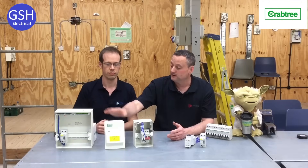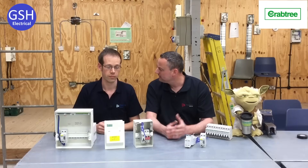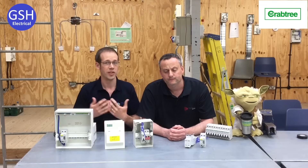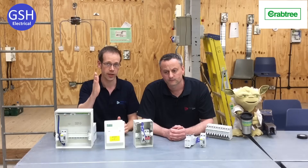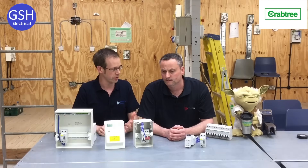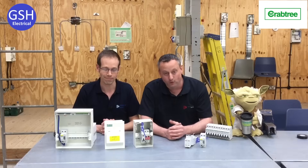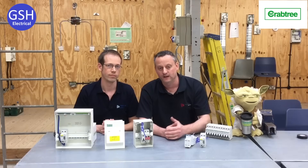The issue we've had with the main switch being an RCD — in these cases RCCBs — is that we lacked discrimination, a word that's been changed, is that right Joe? Currently under the 17th edition of the regulations we use the word 'discrimination', which indicates that if a fault occurs on a circuit it only disconnects that circuit and doesn't affect other circuits alongside it. But under the 18th edition of the regs, it looks like that's going to change — we're looking to move over to the word 'selectivity'. We haven't physically got a copy yet, but we're presuming it's changing over to selectivity.